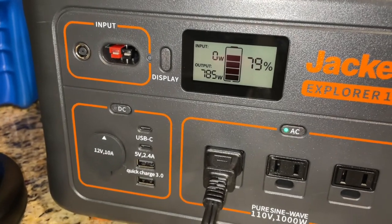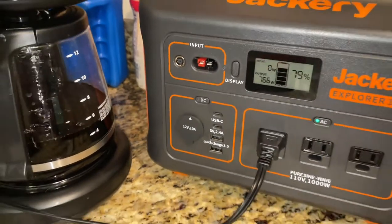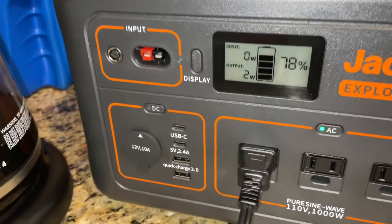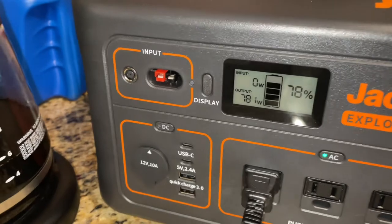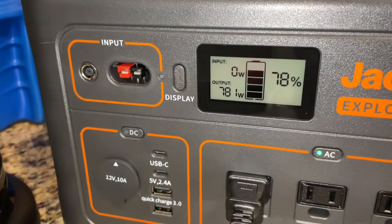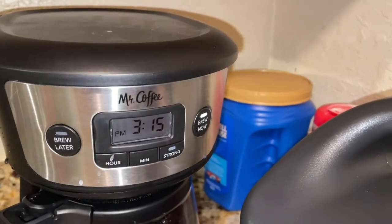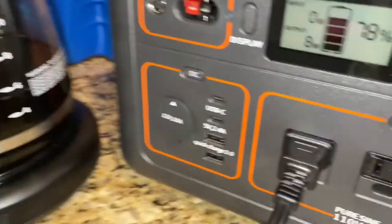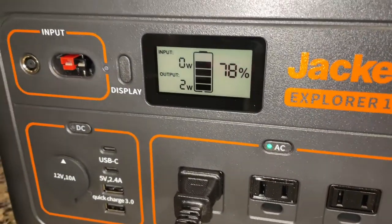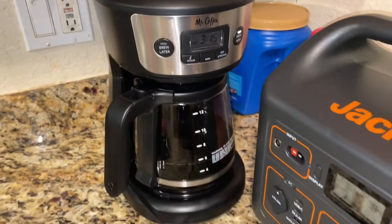This thing has not quit. It's right around 780 watts. The Jackery 1000 can jump up to about 1,100 or 1,200 watts before shutting off, and it has a 2,000-watt initial startup. When it stopped pumping the water, it goes down to nothing, but then the heating element to keep the coffee hot cycles up and down — the coffee maker never quit. The light is on; it just cycles for a second to keep that little heating element going. So the Jackery 1000 can totally handle a full-on Mr. Coffee.